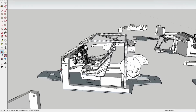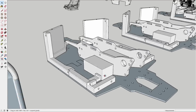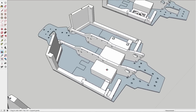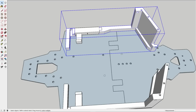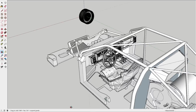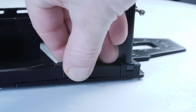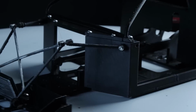Right, the battery issues. I flipped the battery flat and wedged it behind the seats, adding seat rails to slide the seats forward out of the way if needed. I'm trying to think about battery leads and access to them. The battery slides in via a latch. I originally designed it to have a magnet. It enters from one side and it can't rattle out. I don't know if it worked well because unfortunately this version is riddled with some other issues that require a full redesign.